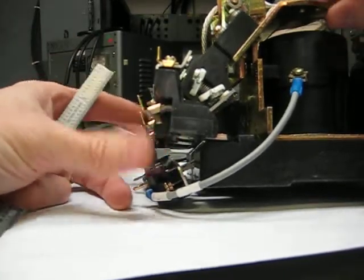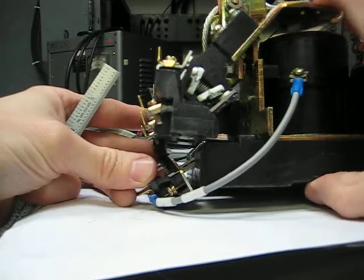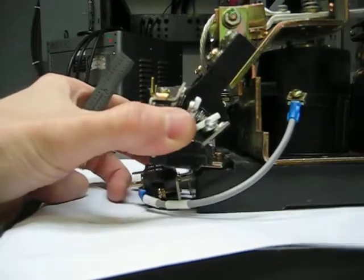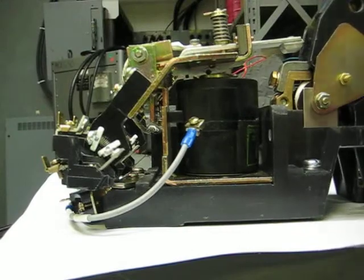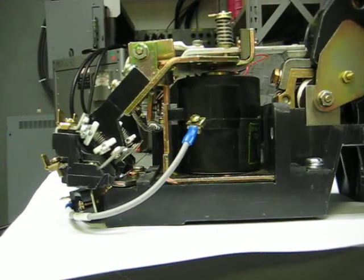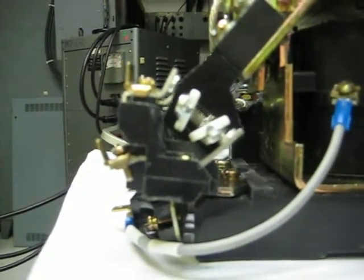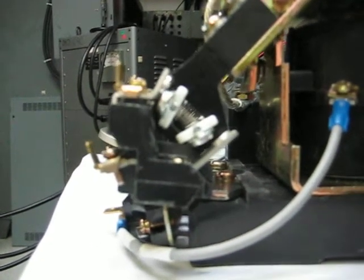So when we energize this contactor, it is not releasing or allowing the tips to open. And we can move over, we can show the tips as well, and we see that it is remaining closed. And those auxiliary contacts over here, the stationary and the movable contact, are binding together.